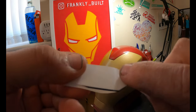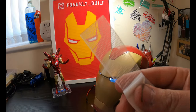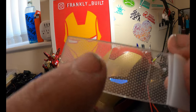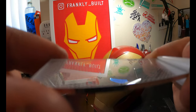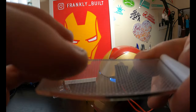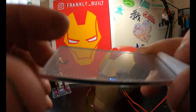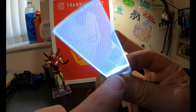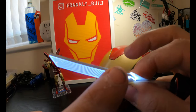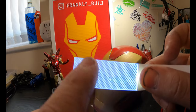Right off the bat they come with these white screens on them. What I like to do is take a little exacto knife and cut right there to leave the cover. These are clear acrylic lenses. One side is really smooth — you can see all those dots and the reflection from the room. If I flip it over, there's a little bit of a rough surface with less reflectivity. There's a small LED inside, and around the entire perimeter of the acrylic is a chrome silver piece of tape that reflects all the light in.